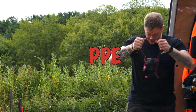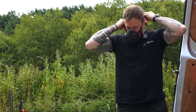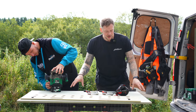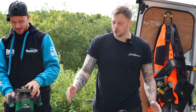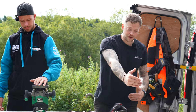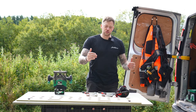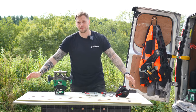Safety first — PPE. While Sammy sets up the router, the reason why I've chosen this piece of MDF is: one, because it was an off-cut and didn't cost me anything, and two, because it's perfectly sized for what I think the best uses of an MFT top table are going to be for me. I've gone for 800mm wide and 1300mm in length, so I can use it for anything that's 1200mm wide, but also when I'm setting out door linings and frames I can set them inside the 800mm and have full support all the way through.